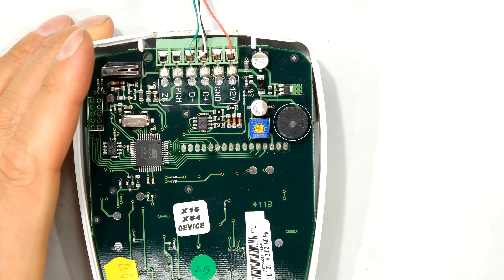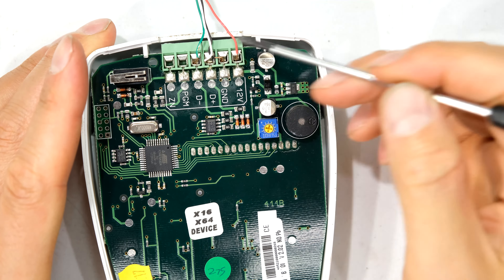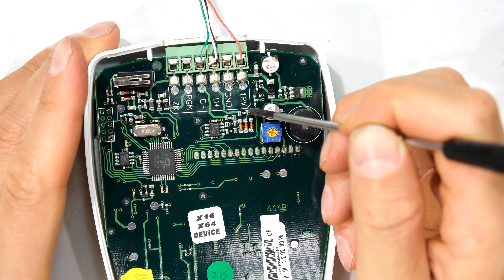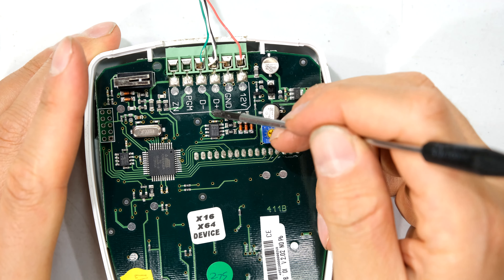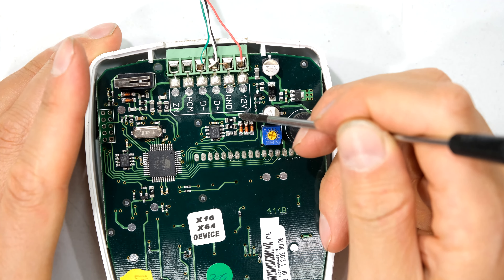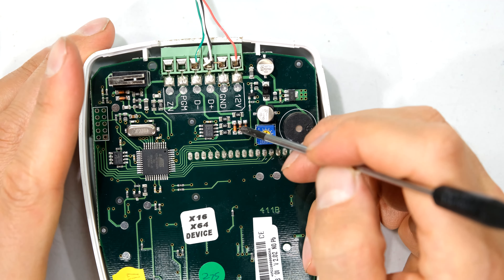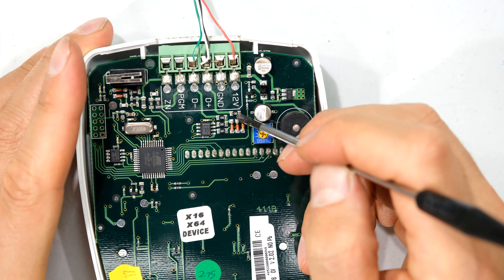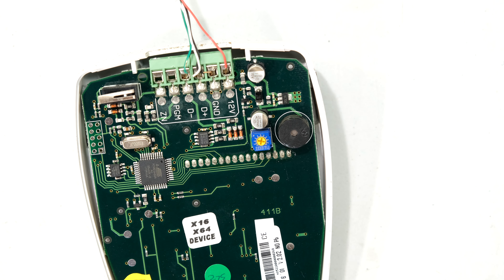The problem is the input resistor from the D plus. I've disconnected the power. From the D plus it goes through a 10 ohm series-connected resistor, then to a diode. From the D minus it also goes through a 10 ohm SMD surface mount resistor and then also to a diode. There are two diodes here and then a third one. Two of these diodes are broken and both resistors have popped.